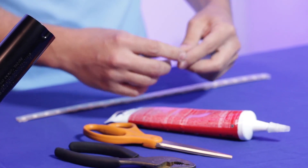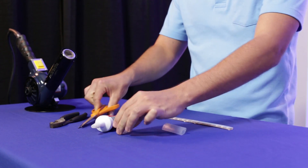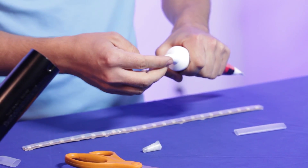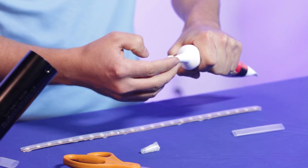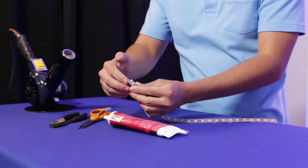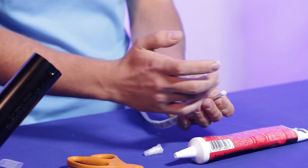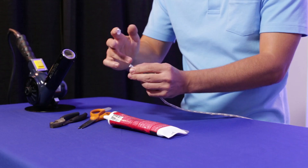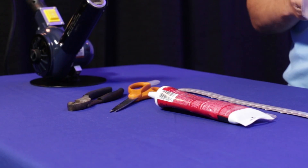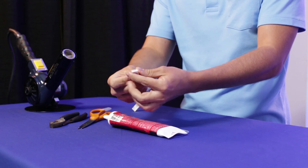The first thing you want to do is get your heat shrink tubing and cut off maybe about an inch with your scissors. Once you've cut that, set it aside. Then get some of the silicone — you can put it on your finger and squirt it right in there. Push it in there with your finger so that it goes in and creates a barrier so that moisture doesn't get in. This is somewhat of a double seal type of technique.